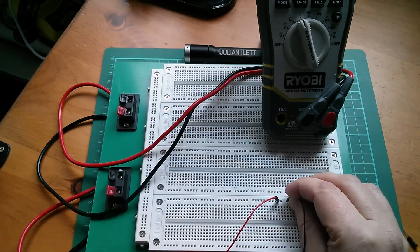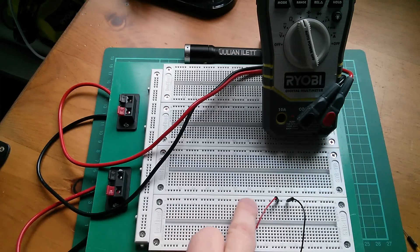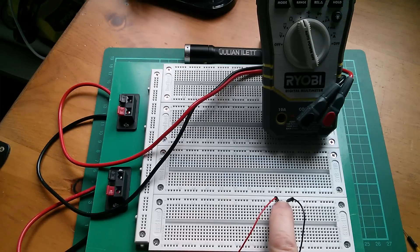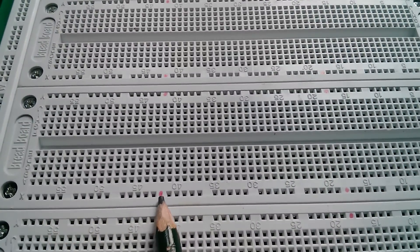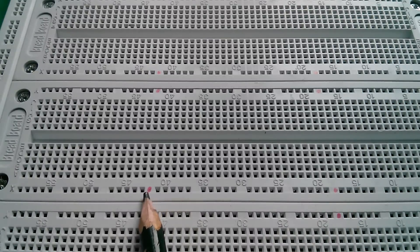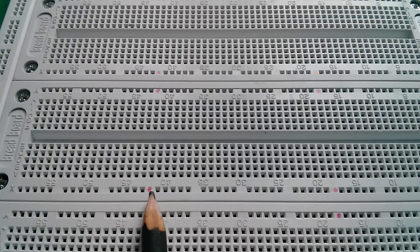There's a break at that point too, so these are the same. I'm going to have to mark these with a red dot because these power strips have breaks after the first three holes, then after seven — with three sections connected together. I've marked all the points where there is a lack of continuity with a little red dot, as a reminder that you have to put a wire jumper there to get a continuous VCC or ground.